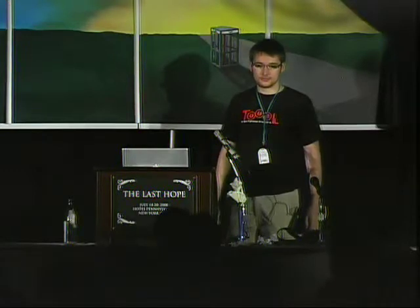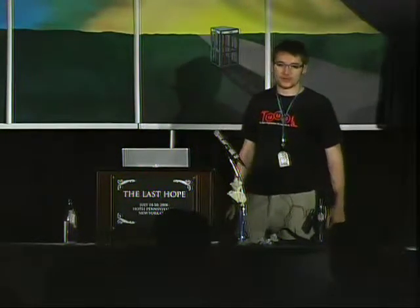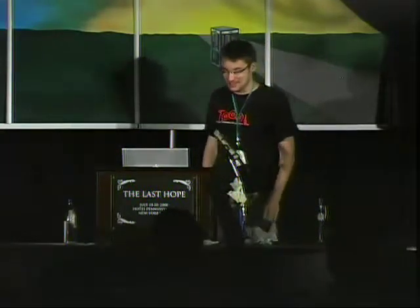But another quick point about cheap safes. If it has an electronic lock, it's almost assuredly yeah. Some of them just really get a 9-volt battery with a pair of wires on it. Having poked around a few control panels on electronic safes, I found a couple of wires hiding out under them, and then opened it up and realized that the wires went directly to the solenoid, exactly. And realized that your average 9-volt battery with some alligator clips will open it. At least part of them, if that's on purpose, it's the emergency get-in mode, you see. But otherwise I don't trust my safe manufacturer enough to do that.